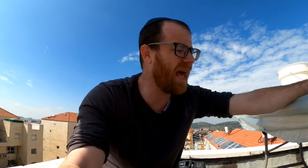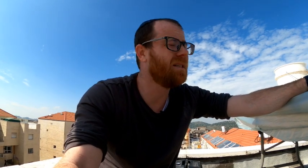My goal is to get it in within a pot - I got to mix it and then get it inside and expand within three minutes. I'm working by myself, so it will be a bit difficult. I actually cooled down the material last night, so when the material is cooler it slows down the reaction time. That should give us any extra time - if it's 30 seconds, a minute, it makes a big difference. So let's get started.